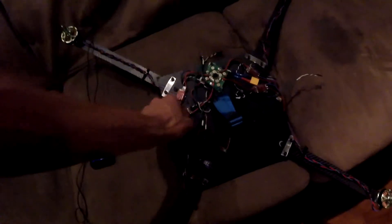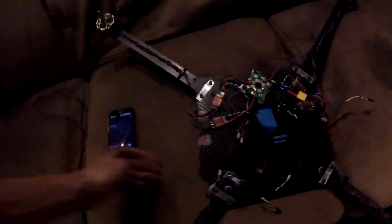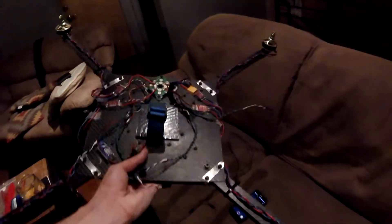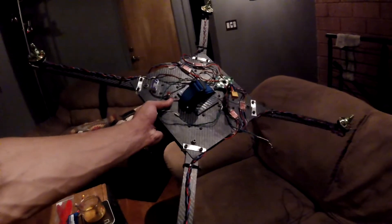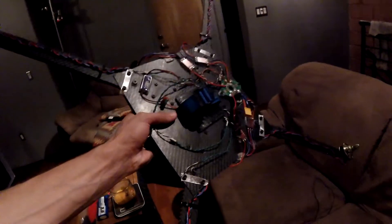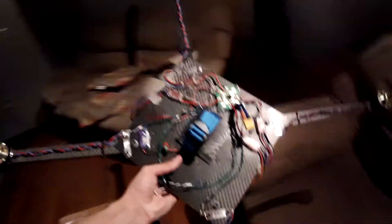It's going to be a fun little build. Here's a little weight test: this frame by itself was just under 500 grams, and it's a 900 millimeter frame. You can get an idea of what kind of weight savings you can shave off — five or six hundred grams, that's another battery or half a battery depending. The total came in at 1.138 kilograms.